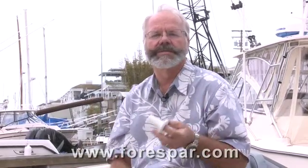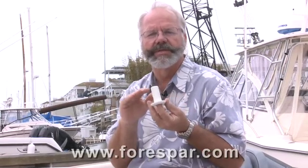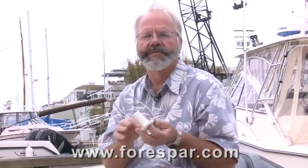It's important to note that marine through hulls all have parallel threads. No matter if they're US thread, BSP, or buttress, they are all parallel threaded. This is because no one ever knows the hull thickness they're going to be installed on, so a taper would cause problems — the through hull threads need to be cut to length for a given seacock or valve installation.